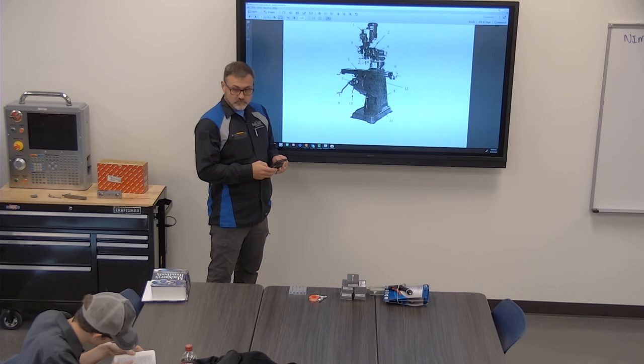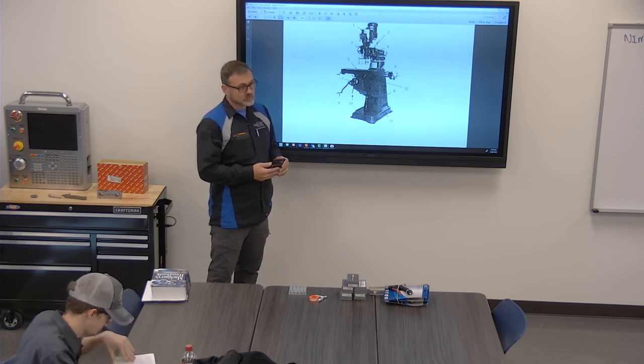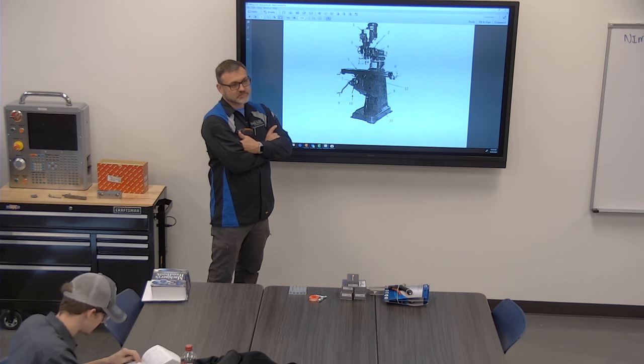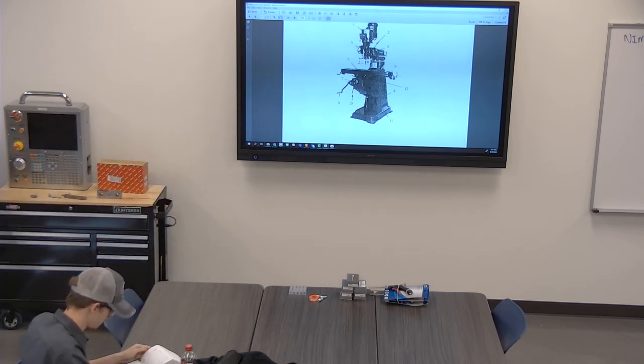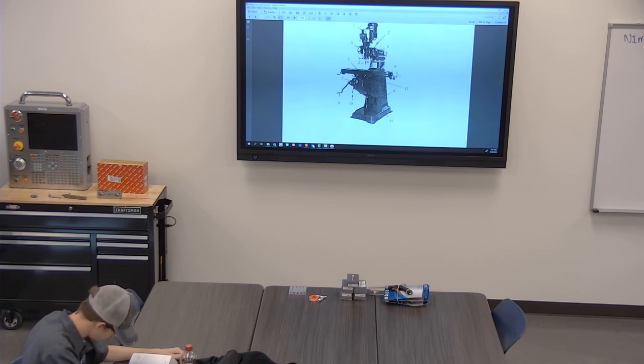Just looking for a page number? I'm looking for a dimension. Chance, got it? Oh, you look like you're back there confident, just going, I'm gonna wait till these fools find it. At that point, I don't think that matters. I mean, you've got a standard keyway for a 1-inch shaft. Yeah, just a square. Let's just say for a 1-inch shaft, I think 1/4 inch is probably standard.